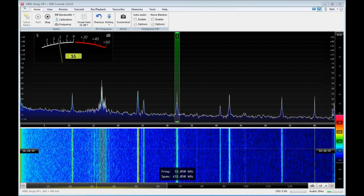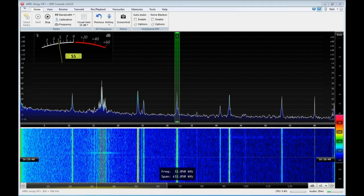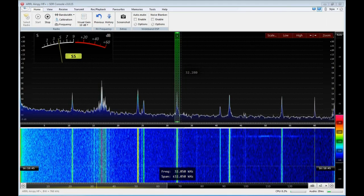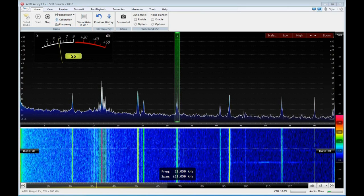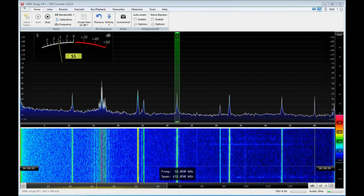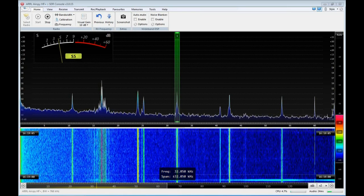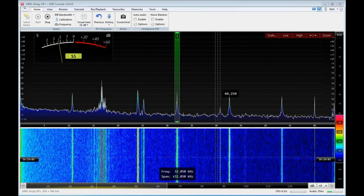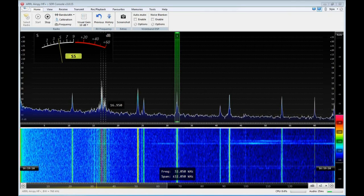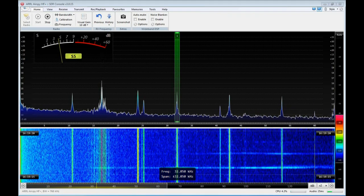Okay, we're back. It's getting cold out there — it's about 26 degrees in Northwest Connecticut. You can see that the signal went from an S8 at 33 kilohertz to about S5. Dramatic, dramatic difference. Both common mode chokes need to be in place to eliminate as much noise as possible. I'm fairly confident that most anything leaving on the coax cable with the choke on either end is pretty much eliminated.